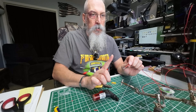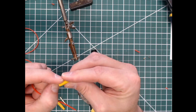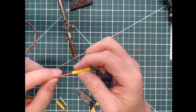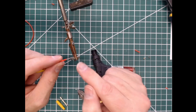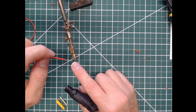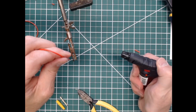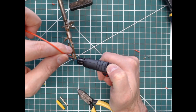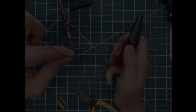Now what I'm going to do is heat this and stick the wire in. But before I do, let's remember to take this cover that was on there and put it on the wire first. Maybe I should have done that before I stripped the wire. Okay, now let's go ahead and supply some heat to this — get that solder hot and melted, dip the wire in, and then take the heat away. I saw the solder melt. It's in there — heat away.